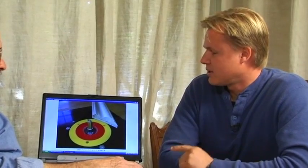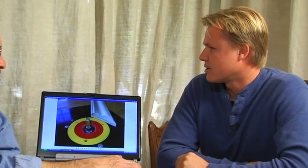They have to match. They both have to match. So you saw where the two templates were next to each other. You saw the slight radius. So both ends have to be cut at the radius. I see. So this is the opposing side, the opposing radius. One is an outside radius, one is an inside radius. So that's why I cut both pieces slightly long, so I could just shave off the last quarter inch with the router bit.